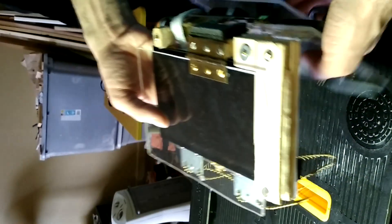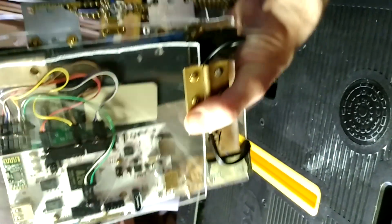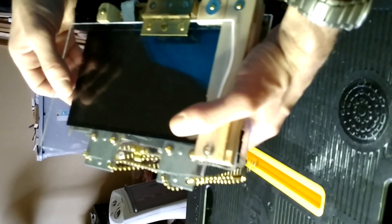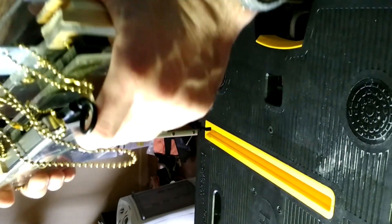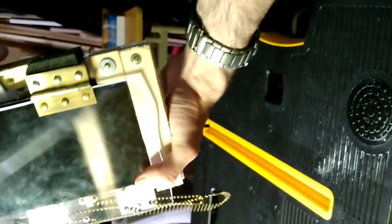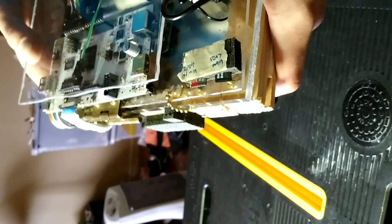I had to add extra protection so it could close and open on one side for the touch screen, and close and open on another side for the PCDuino itself. I have little latches with chains. I can bring this to a coffee shop or wherever and do some reading in Android mode. I mounted everything to cheap acrylic that I cut on my miter saw — quite the nightmare, but it worked out. I doused the ribbon cable with silicone to protect it, since that's a bit of a weak link.